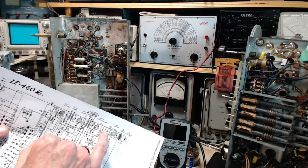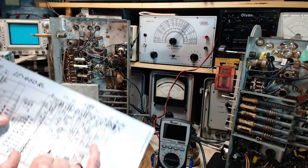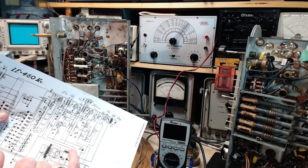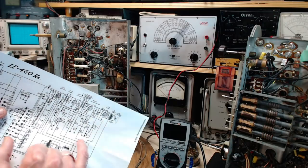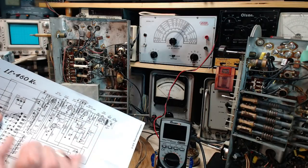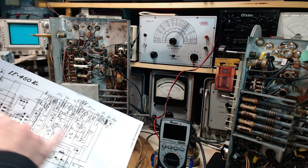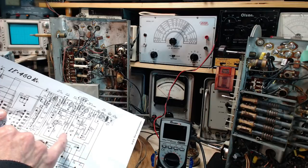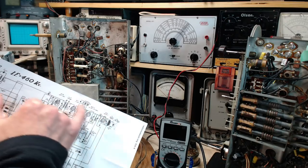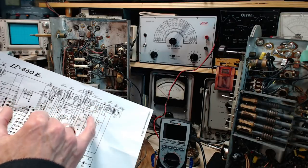Through this one. But what about this one coming into the tone control? So the tone control, is there a ground on it somehow? Wow, it's all through this stuff. Ooh. So there's no solid DC ground here. Make it easy to look for a leak. Well, we'll go to the chassis. This, I think, is carrying a bias voltage all through this stuff and up onto the tube ribs or something like that. I don't really know what's going on. I haven't analyzed it enough to know yet. I'll probably get there eventually.